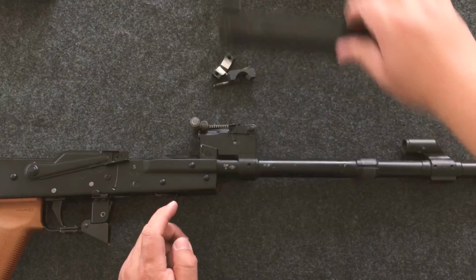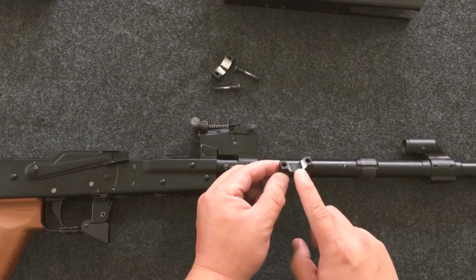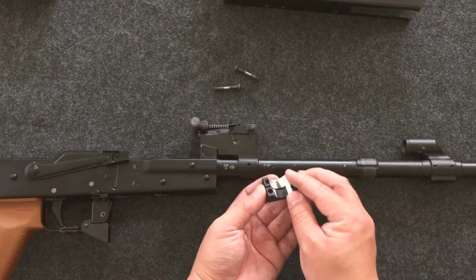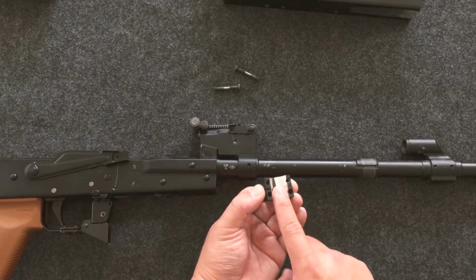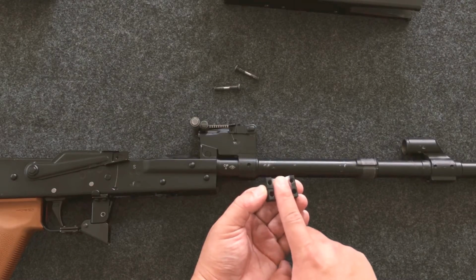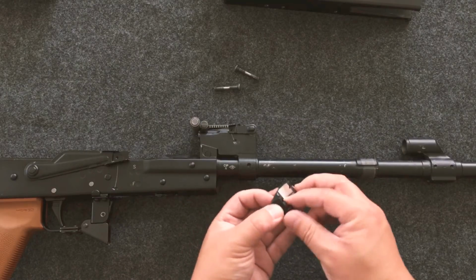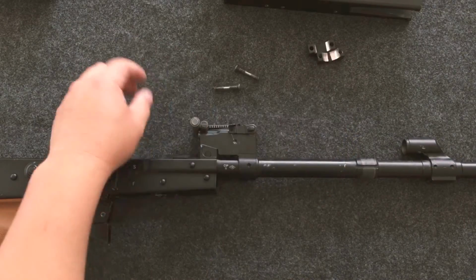So this was my version 1, and to get the clamps to work, I ended up modifying the original clamps. I machined them, you can see the white in here. They're different because one's a top clamp and one's a bottom clamp. I had to machine them differently because I was running out of material. I basically took an end mill that was very close to 20.3 millimeters, I think a little bit undersized, in a manual mill and cut these as far as I could without cutting into the holes for the fasteners. And these grab on much better than the originals. So we'll call that my first attempt.